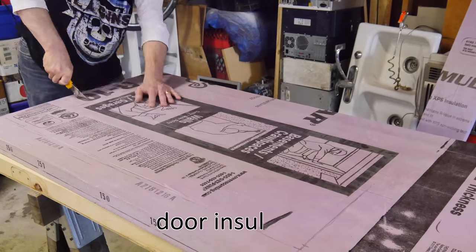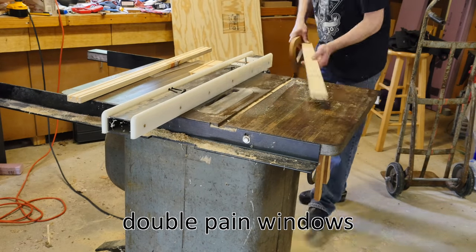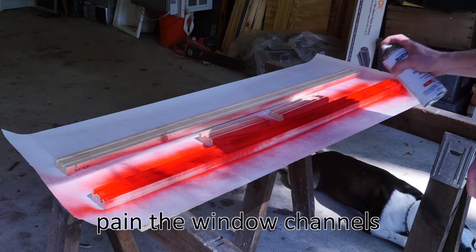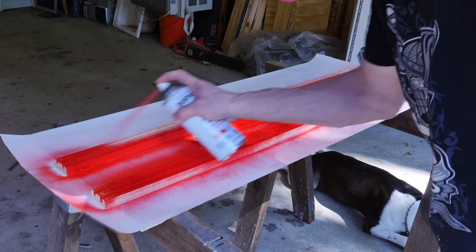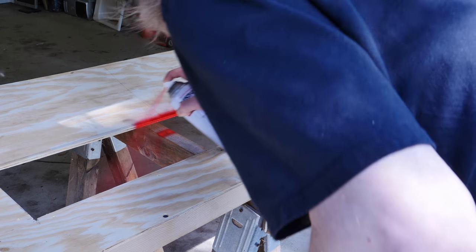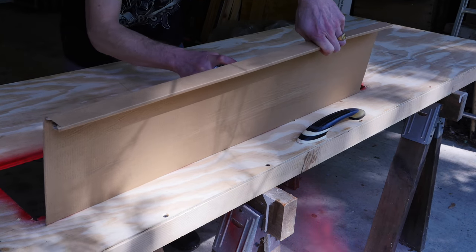Let's turn our attention back to the door. We've got to add the insulation in the door just like everything else in the unit. The door has a window, and I'm cutting grooves for where the glass is going to go on the inside channels — we're going to do a double-insulated window with lots of extra room. I'm using a little Rust-Oleum enamel here. I kind of really hate their products, but they had a red cherry color that matched the turnbuckles perfectly. So this is my little red accent — no primer, no nothing. Just give it a couple coats, make it red, and the edges of the quarter-inch plywood get a little paint as well. I use a piece of cardboard to mask off so I don't get any paint on my handle.